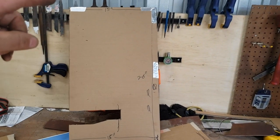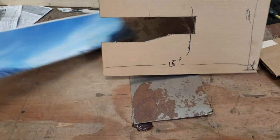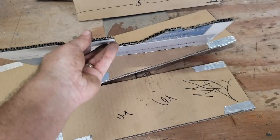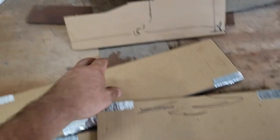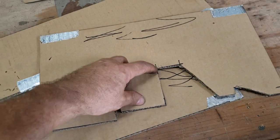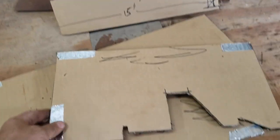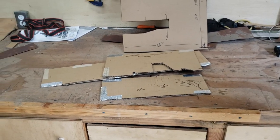I'll show you how I made all this — I use cardboard templates. Just started out by cutting out the dimensions I needed and then cutting out little pieces. As you can see I had them all taped on. The good thing with cardboard is it's very rigid so it holds itself up. The thing to keep in mind is that the metal is almost a quarter inch thick, so when you take measurements — I had 15 inches across — I ended up having to come back and shave some off because I hadn't accounted for the extra thickness. So tape it all together, put it on, make sure it fits, then cut the tape, lay it down, and cut it out.